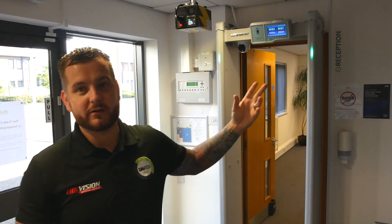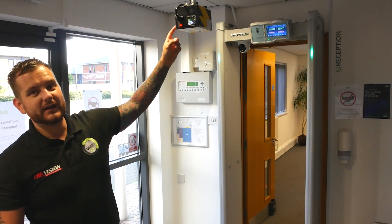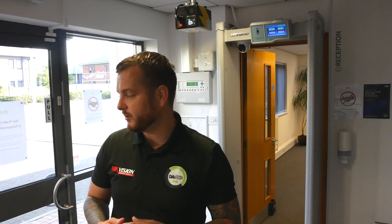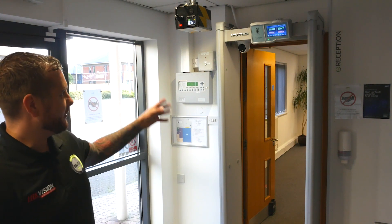As you can see, I've got a black body fitted within that distance measured between the camera and the black body. It's important that we chose the black body to improve the accuracy from 0.5 to 0.3 degrees, and we do urge that you use the black body where possible. The reason being is we've got the outside door here and an entrance lobby, and we want this to be as accurate as possible.